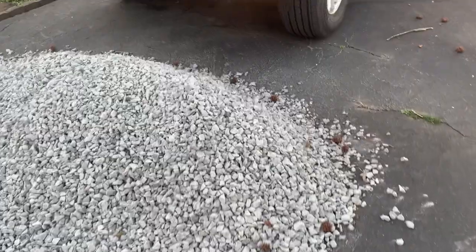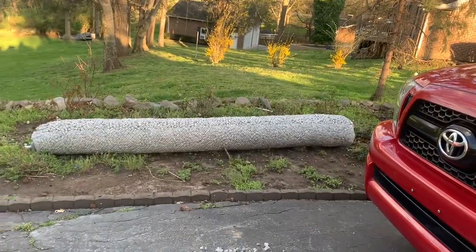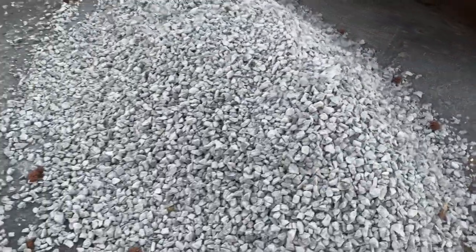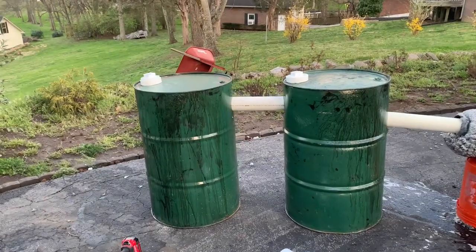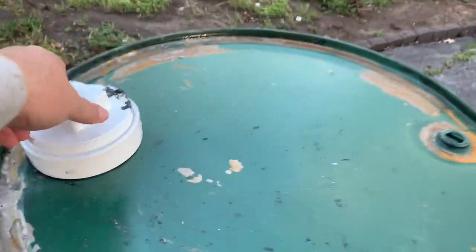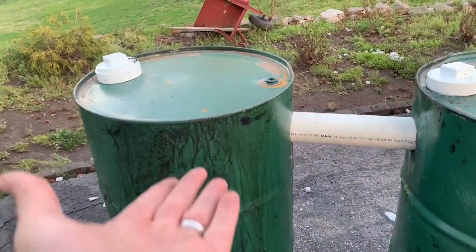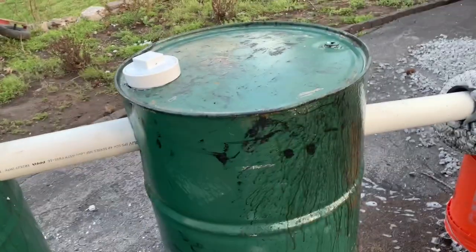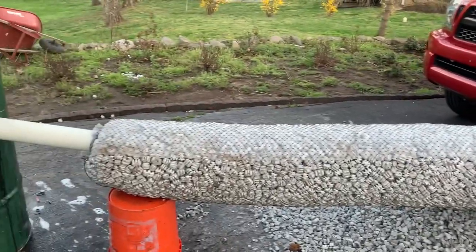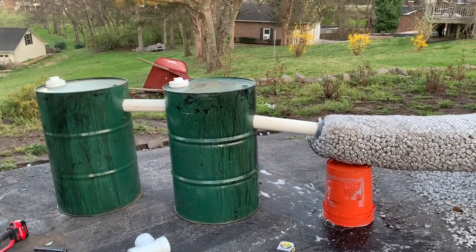I also had a friend drop off a little bit of gravel. This gravel will go underneath the barrels and around the peanut pipe — although that's got a lot of clearance for the water to seep in and around, you still want to put gravel underneath it. Here it's all pre-rigged for when my friend comes out with his excavator. We have the first tank with the clean-out right here. The waste level will rise up, go into the second tank, rise up, go into the tailpiece, and into about 12 feet of peanut pipe. That's it in a nutshell — or peanut shell.